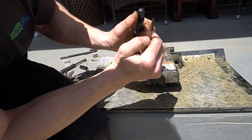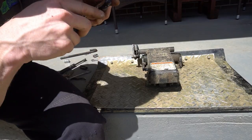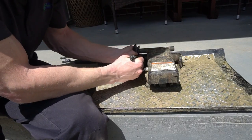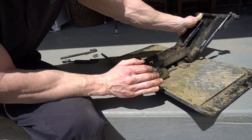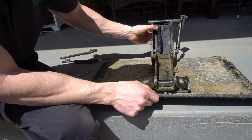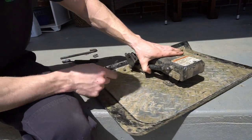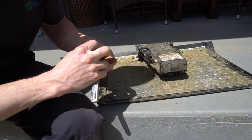My clip is not on there just right so I need to shimmy that a little bit to get it back in its spot. I'm going to attach the original spring back onto this side because it may not be the issue after all — I'm leaning towards it being this one. This should have a lot of tension on it right here; you have to be really careful because it'll snap back on you, but it is not doing that because it doesn't have any tension. To get this shock off, you want to pull this pin right here — it's going to be a 13mm.